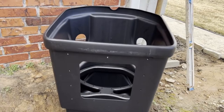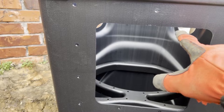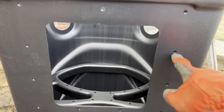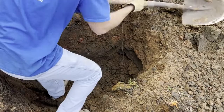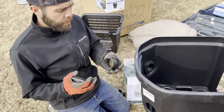One of the ways we decide where our water level is going to be: when the faceplate is on, we want the water level to come up to about three-quarters to an inch below the top of the skimmer mouth — that usually means right at this bolt right here. So we're going to shoot for water level and dig this down and bury the skimmer right about where this bolt is, so the water level will come up to it, and then we start building the rest of the pond around that.